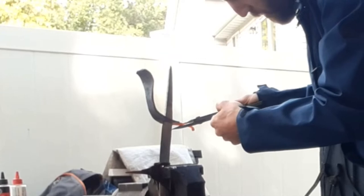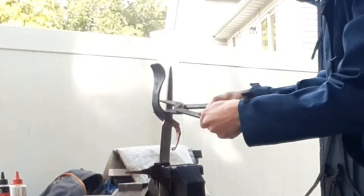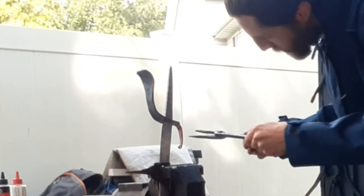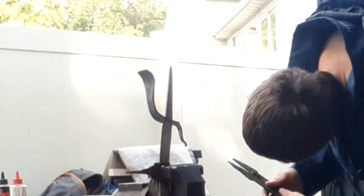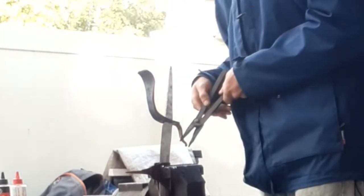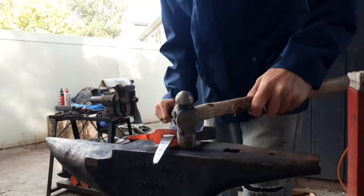Now what I've done here is I've just slid it down onto the sword tang, and I'm just using a pair of scroll tongs in order to adjust that rear quillon where I want it for that blade catch on the rear end. Just bent it down and gonna kind of bend it back and out a little ways and then off-center it from the blade ever so slightly, because the historical examples would have something slightly off-center if they had that type of blade catch.